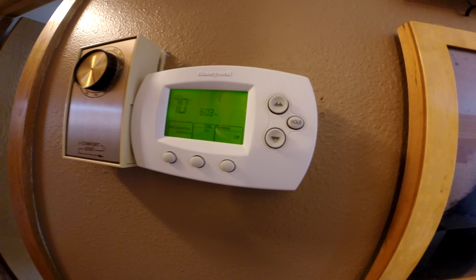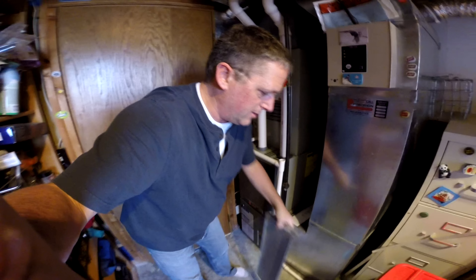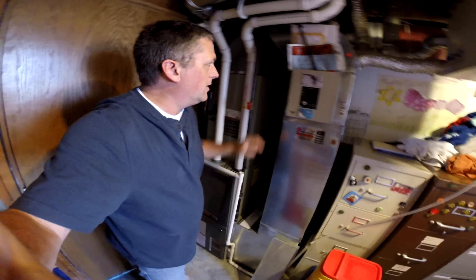You'll have to let the fan actually shut off the fan too. If you don't have the capability of shutting it off at the switch or thermostat, then you might be able to shut it off at your circuit breaker box. What I recommend, if you've never done this before, is that you really should have a furnace inspection anyway every two years — just have them tell you where to shut it off. You basically just remove the cover or find where that air filter is located. It's going to be located where your air return from your house goes into the machine.